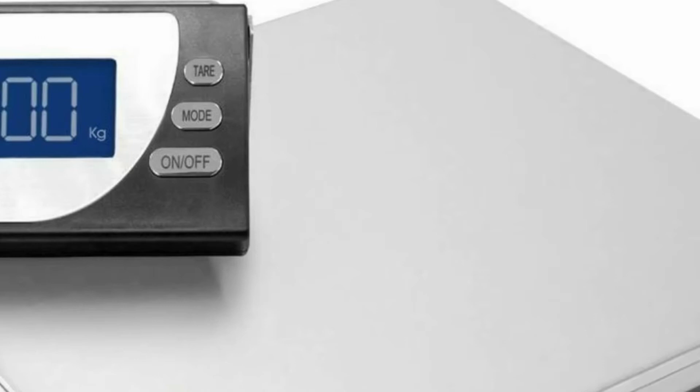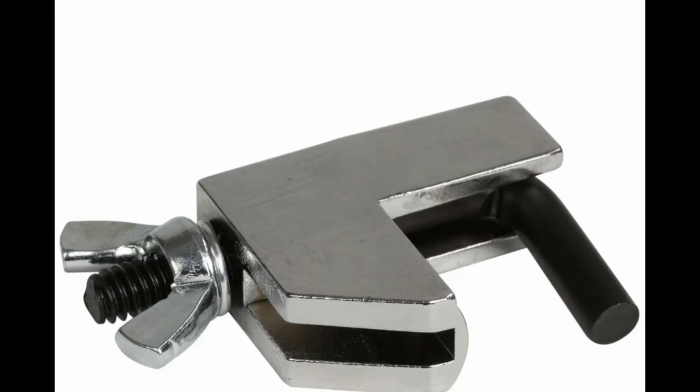If you're using carbon fibre, aramid, woven or twill e-glass, then it has to be a 1-to-1. If you're using chop strand mat, for example, you would then use 2.5 times the weight of resin to the weight of material. So if you've got 1 kilo chop strand mat, you would then use 2.5 kilos of resin. If you don't, you end up with either a resin rich or a resin poor product, and then the quality isn't as good.